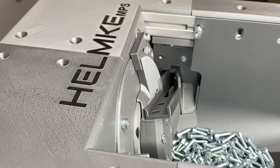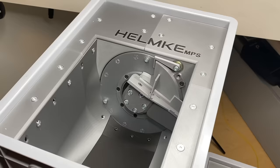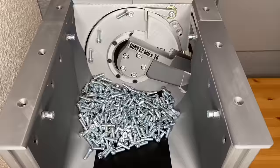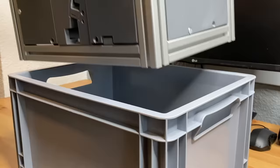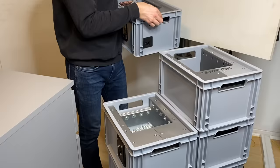During the last years I've manually packaged and counted thousands of different screws, nuts and washers, all for 3D printed parts that I sell online. So I used 3D printing, PCB design and other processes to build an automatic screw counting machine. The design is based on some fundamental principles and it is parametric, so it should work for a variety of conveyed parts. In this video series I will go over the components and how I build them. If all goes well, the videos will end with a working modular production system.